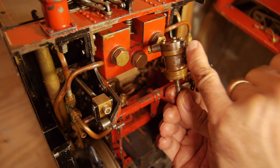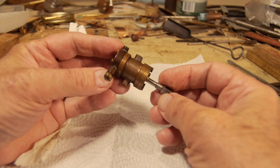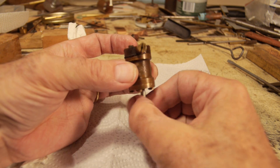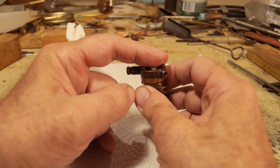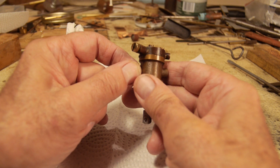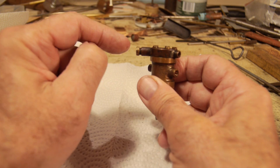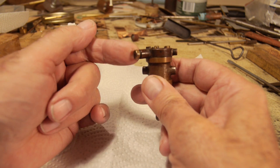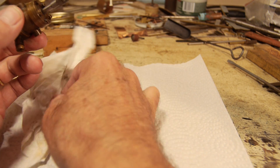Let's put that on the bench and see what's going on. Getting a little bit of the muck and oil off the brake cylinder — you can see it's quite a hefty piece. Here are the actuating arm and the trunnions which allow it to pivot. That's the inlet here, and this allows steam to warm it up, because every time you use the steam brake after running for a bit this will be cold. It allows steam to circulate through the cylinder and pass out through this little screw here until it gets up to a certain pressure.